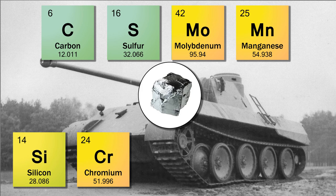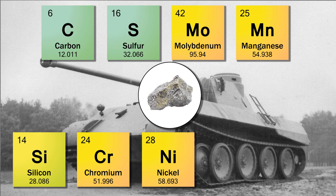Chromium is also a powerful alloying element in steel. It strongly increases hardenability and markedly improves the corrosion resistance of alloys in oxidizing media — it's prevalent in stainless steel, for example. Its presence in some steels could cause excessive hardness and cracking in and adjacent to welds. The German armor examples had between 1.25 and 2.13 percent chromium, or higher.